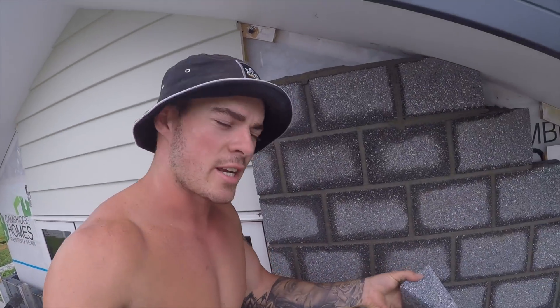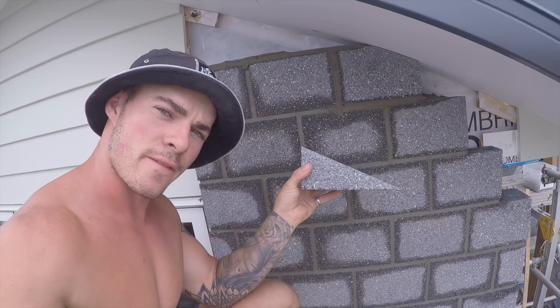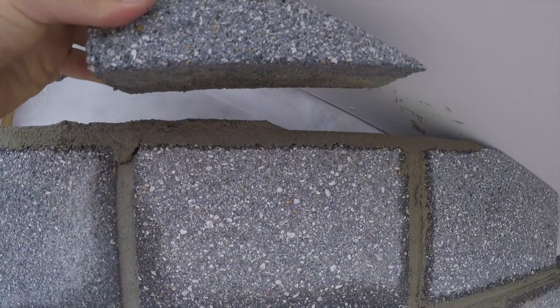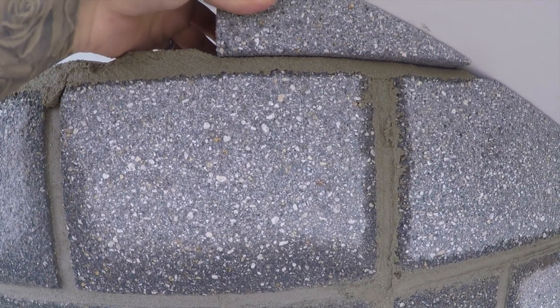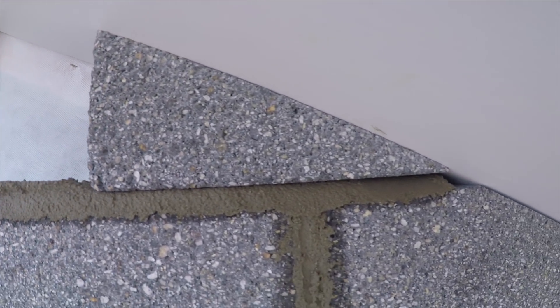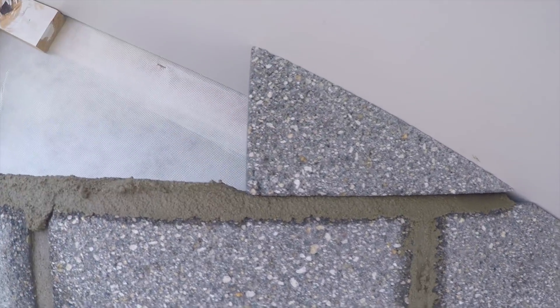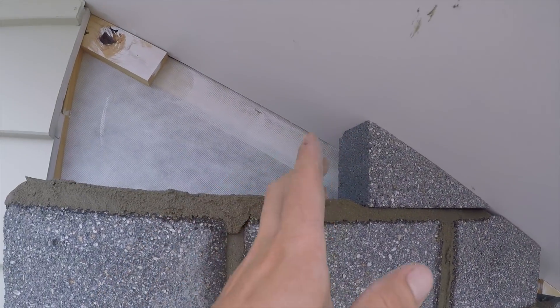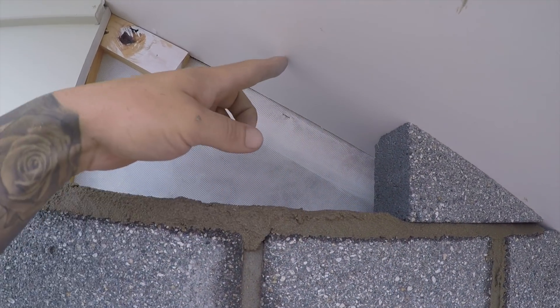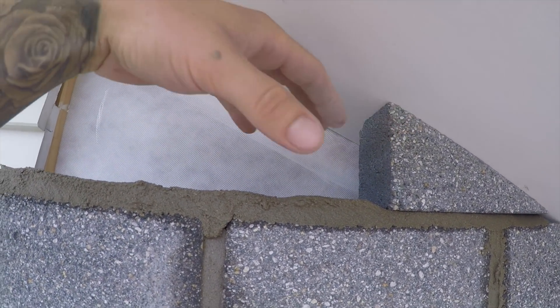I've just got Bucky to cut the brick. That's what it looks like. See if it fits. Perfect. Doesn't get much better than that. And then you just do the same thing over and over again — measure that distance, measure across till it becomes a full brick, from point to point. That's your angle. Lay it in.